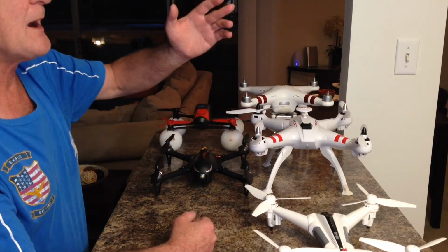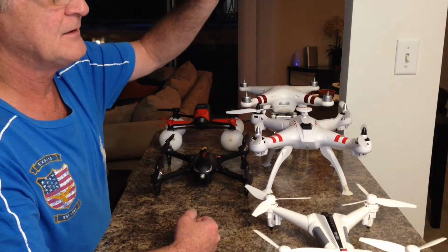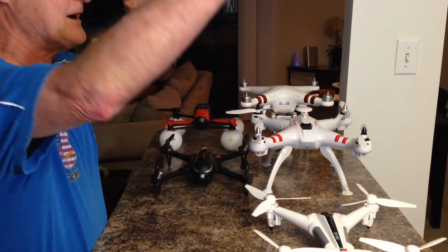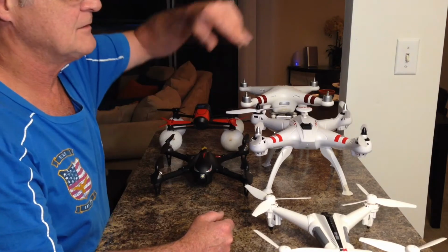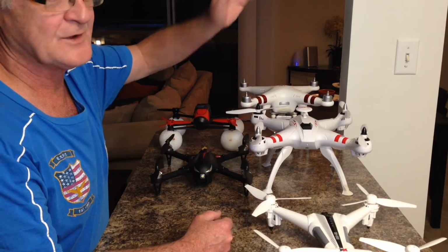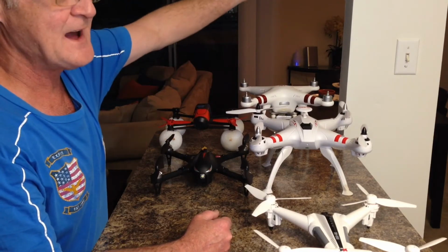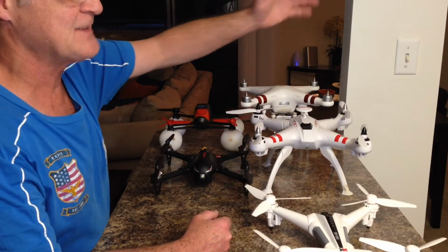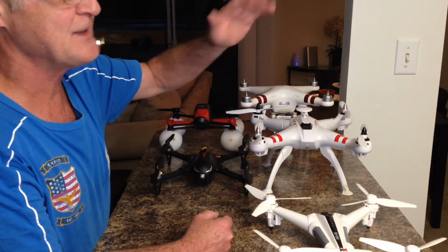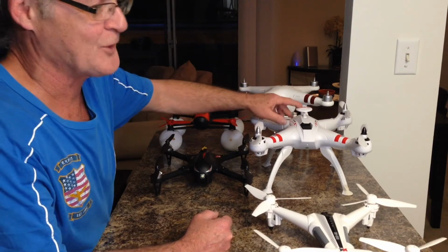So you take them up 200 feet, 300 feet in the air, that atmospheric pressure changes, or there's some storm going on over here or over there, you lose your signal, that thing's gone. Okay, it's gonzo. It's never coming back. You'll never see it again, because what it's going to do is keep flying until it finds that barometric pressure that it thinks it needs to find. So it's not just going to drop out of the sky, because it has this barometric pressure altitude hold.